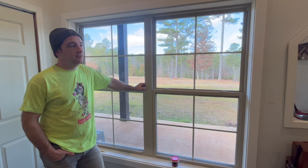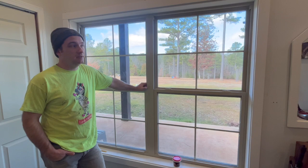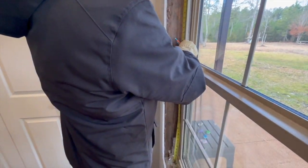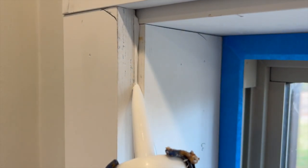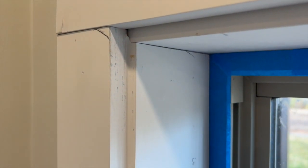Casings are into the world of finished carpentry, so you've got to be real specific with your measurements — down to sixteenths on your tape measure — and you want everything real tight to keep your gaps down. We're filling the nail holes with sheetrock patch compound and we're going to caulk all the linear seams on the inside and the outside, and any kind of cracks.